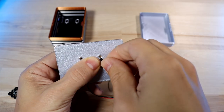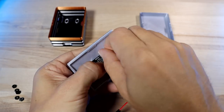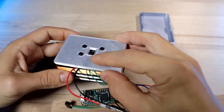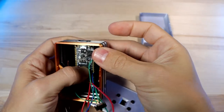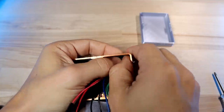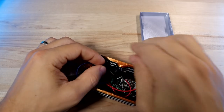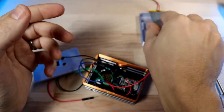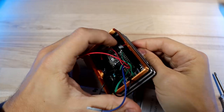The last thing to do is put it all inside of our 3D printed shell. The only thing that you really need to watch out for here is the orientation of the gesture sensor — you need to make sure that it's oriented correctly with respect to the LED on the front, otherwise all of your swipe directions are going to be reversed. The power switch just kind of snaps into the bottom piece, and you shouldn't need any glue. This hole should be just big enough to hold the LED nice and tight. I'm using a 1200 milliamp hour battery, but there is plenty of room in the bottom if you wanted to get a slightly bigger battery — you just need to make sure that the wires on the connector are the same polarity.